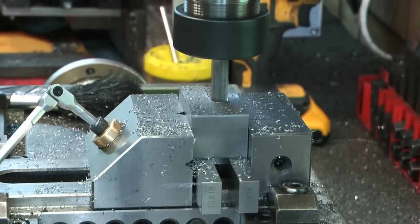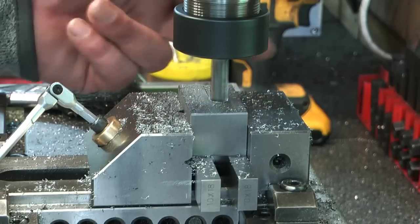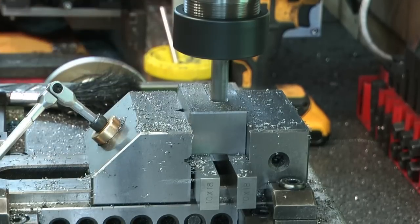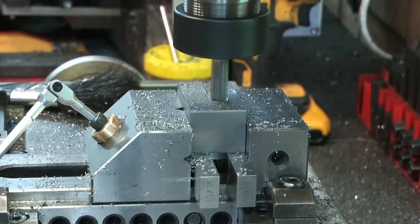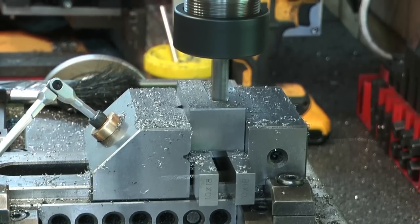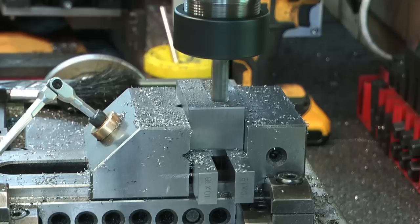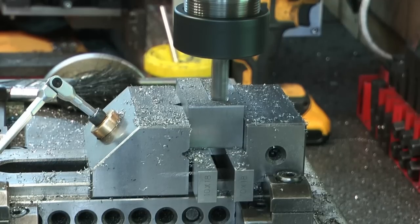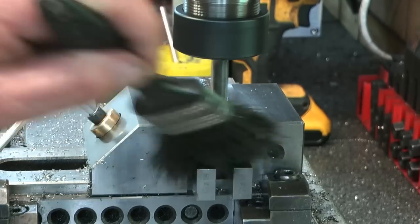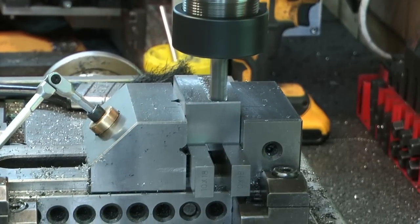I may just step either side 0.7mm, something like that, have a measure of the slot, and just get to that equal reading rather than worry about the exact 6mm thickness. It's going to be in the ballpark - it might be 6.1, it might be 5.9, 5.8, 6.2 - it doesn't matter. Because obviously the height of these is adjustable. Just alter the offset until I get the right width.